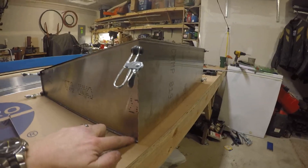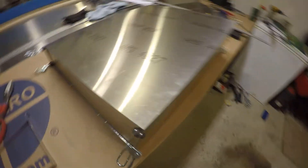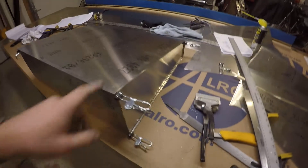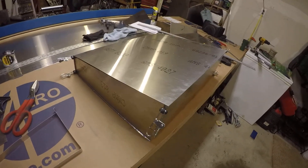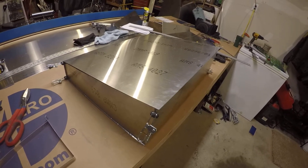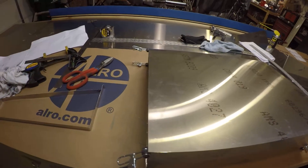The hard part though was basically skinning it. There are a few gaps here that'll draw tight and have to be filled with welding or filler material when they're welded, which I will not do myself — I'm going to have that hired out. Getting the skin to lay properly around the ribs was difficult because these are plans-made ribs. The right and left ones aren't exactly the same — maybe off by a millimeter here or there — and I'm using a DIY bending brake, which means my bends aren't a hundred percent square.